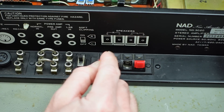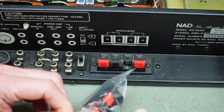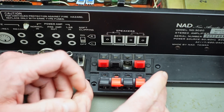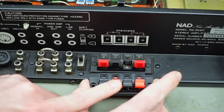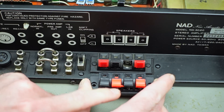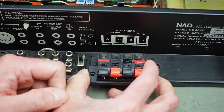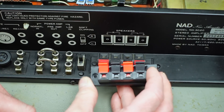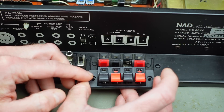So we're going to have to remove this whole thing, which is basically just soldered on from the back side of the circuit board, and find a way of replacing it. Initially I thought I could buy a cheap standard part — I thought these would fit fine. They look kind of similar and have roughly the same dimensions, but the arrangement of the ground and positive is different, so I'd have to rearrange the clips, which would probably end with breaking them.